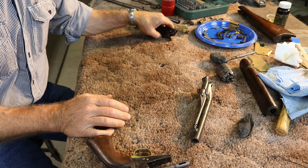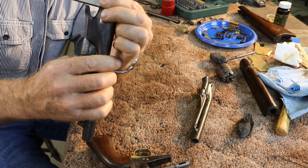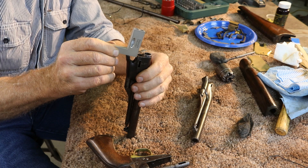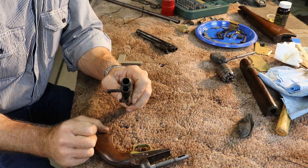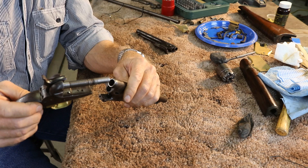Here's the barrel off of our parts gun. You can see that it's been adjusted really a lot. Not only has it been adjusted, but it was obviously done by hand with a file — if you go straight across, you can see the angle is completely different from the barrel face, so it was just hand-filed down. So we put this on the lathe, got it right down to where we wanted it. We've got these two locating centering holes, and they were too shallow for the two pins, so we actually had to deepen those just a little bit as well. But we got it just right and it really sets up well.